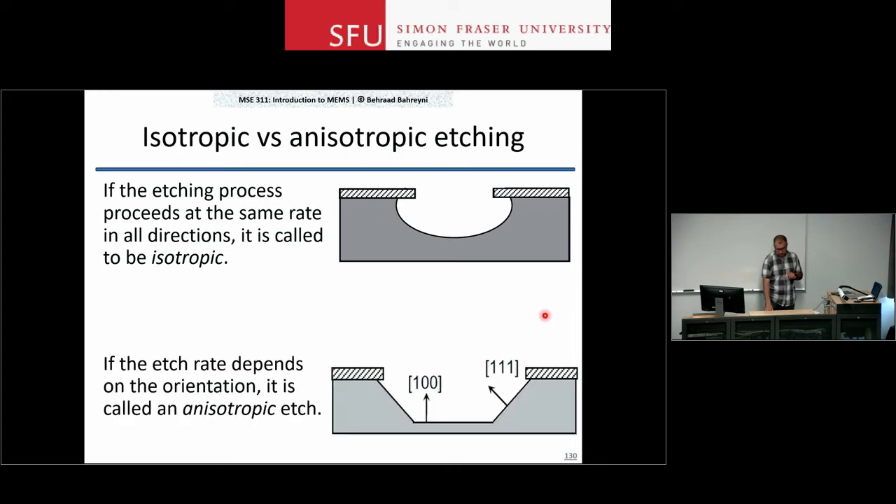Comparing profiles from isotropic versus anisotropic etching — isotropic is shown above. Ideally, in theory, I would expect a circular cross-section for etched areas. If the etch rate is truly the same sideways as downwards, for a small opening I would theoretically see a semi-hemisphere.